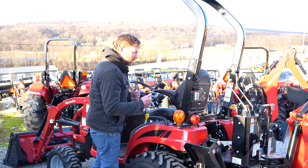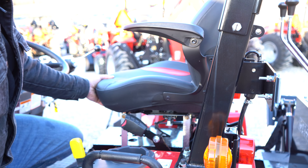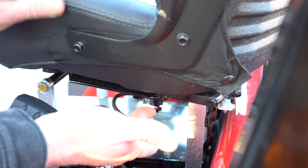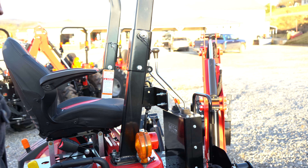When you go to position this for the backhoe, you're going to just lift up on the seat until it's in the up position. You have this latch right here — this latch locks your seat to the front. When you pull this up, you can spin your seat counterclockwise to the rear, and now you're actually ready to jump into your seat and operate your backhoe.